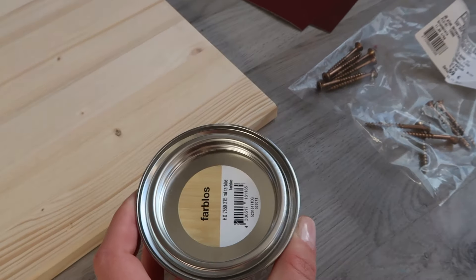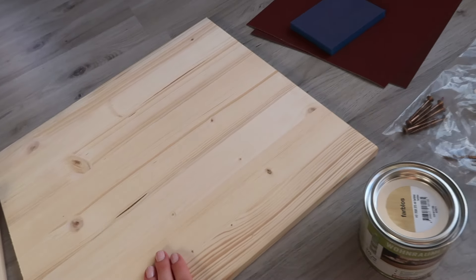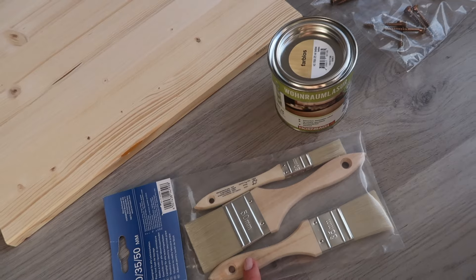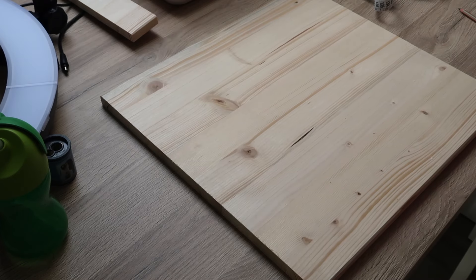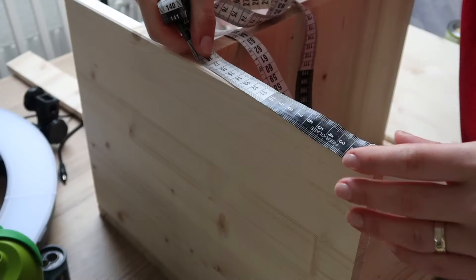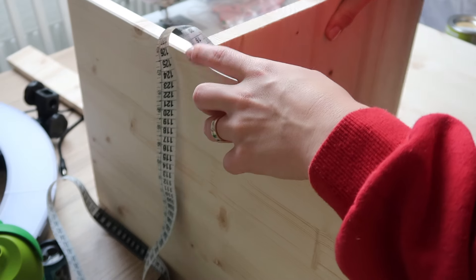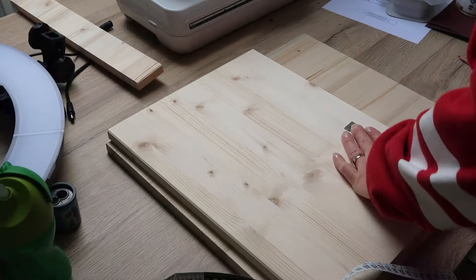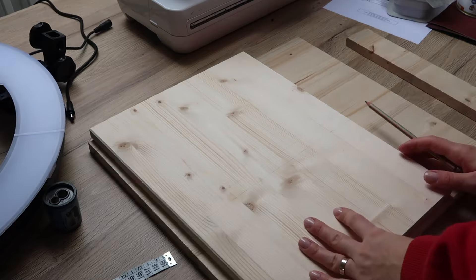The wood glaze has no color, so it's perfect for this project because I really love the color of natural wood. You'll also need some brushes. First I took the back piece and placed everything as if I was building the chair — now is also the time to determine the height of your chair. I went for 17 centimeters and I've used a measuring tape and a pencil to mark out the height of the seat on the side panels. Then I drew straight lines exactly where the wood panels will connect.